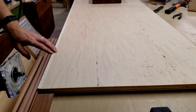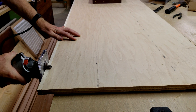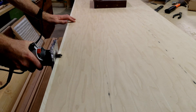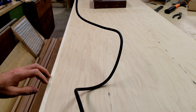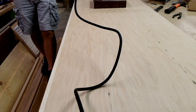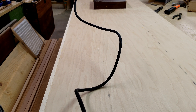You want to move at a steady pace so you're not burning the cut. Because this is so big, I'll place along here and keep moving. The link for this router is in the description if you want to check it out. It does a pretty good job making this nice and smooth and flush. I didn't tear into any of my plywood, which is good. There are a few spots where my glue is sticking up where it didn't get taken off — that's because I didn't have it set very deep, since I didn't want to potentially bury into the plywood. Overall, it did really well. I'll get this side cleaned up and then do the other side.